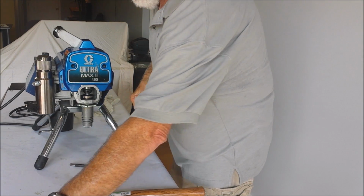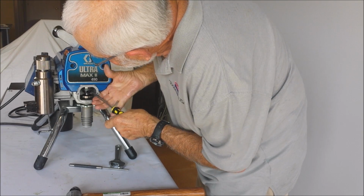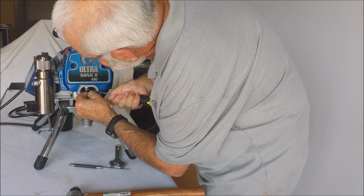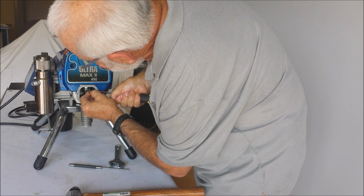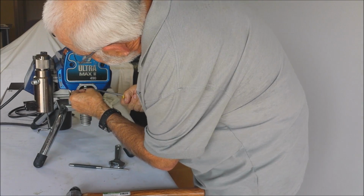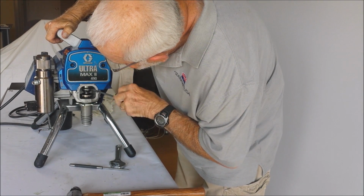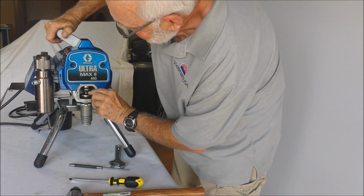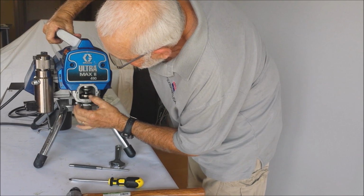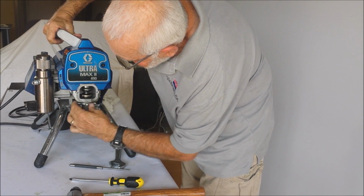You have the piston hole lined up. Take a screwdriver, raise the spring up a little bit to make it easy to start this pin in the slot. Alright, make sure the spring comes down over this pin so that it does not fall out. Once you're at that point there, you want to tighten this nut up so that the housing does not move any farther.